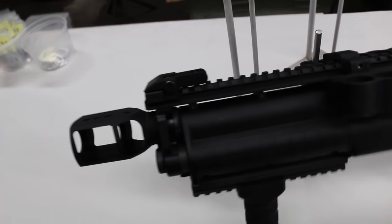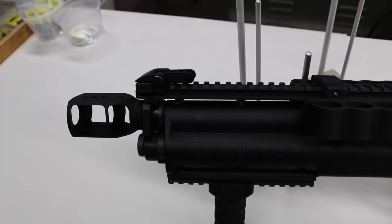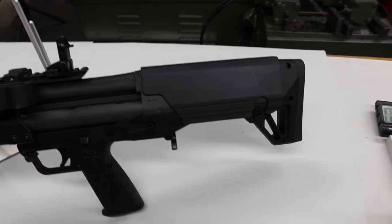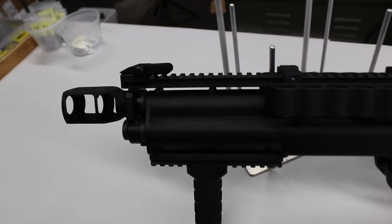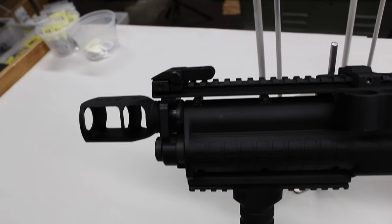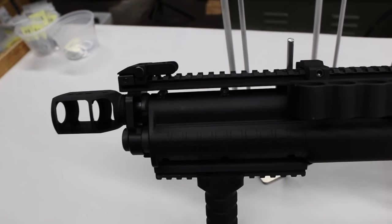It's going to be a little bit bigger. If you're looking for a medium type recoil reduction, we have the Defender in steel and aluminum — about 20% to 30% recoil reduction. It does a great job combined with a recoil pad, which we took off here because you don't need a recoil pad with this kind of muzzle brake. It has double ports, because that's the design the military figured was the best optimal way to reduce recoil from those tanks.